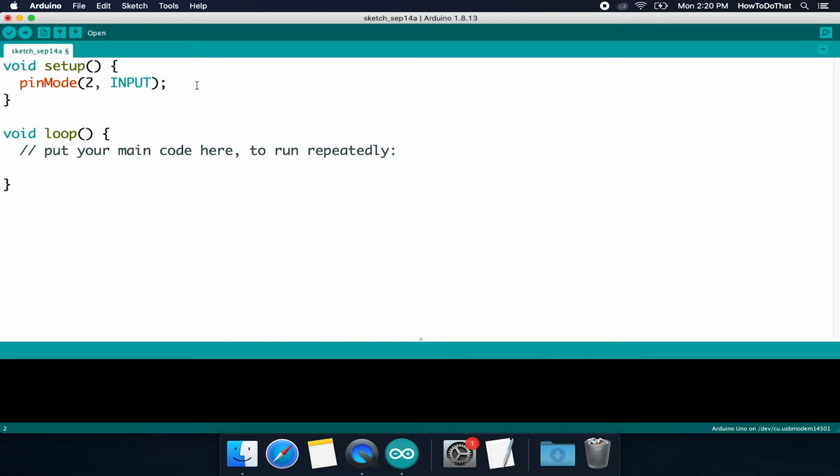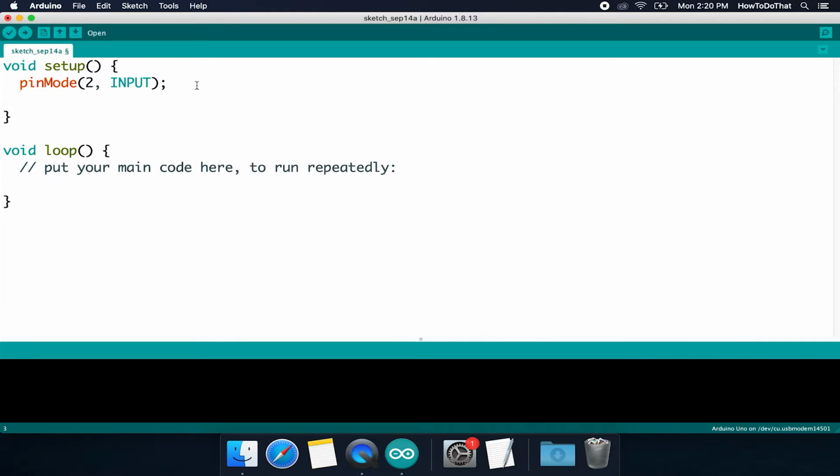It is so easy to forget to put semicolons on the end. The only purpose of the semicolon is that it tells the Arduino, hey, this line of code is terminating. I need to go ahead and execute that line before moving on to the next one. So next we're going to define the output pin, which as we've already discussed is pin number 7, and that is an output. So before we move on, I do want to mention about us declaring this as an input.